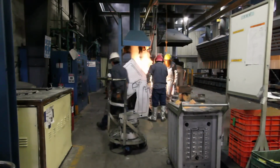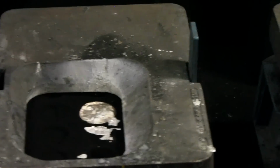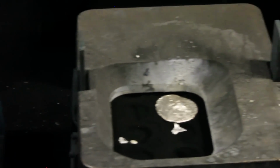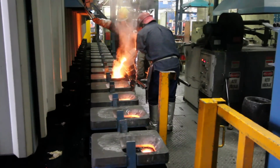Once the mold is ready and the metal prepared, with temperature and chemical composition within specification and free from slag, it goes on to be poured into the molds that are moving in the casting and cooling carousel.